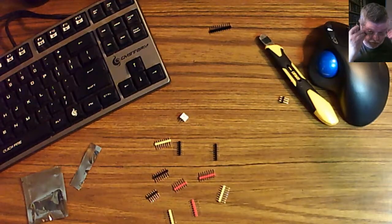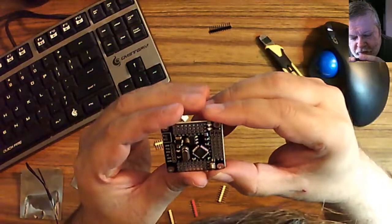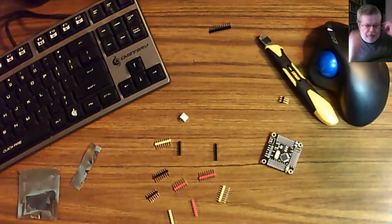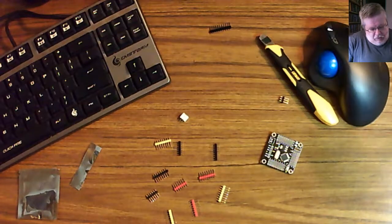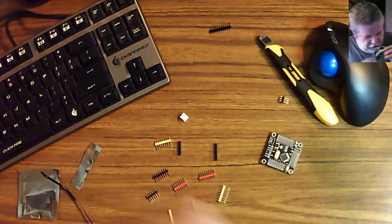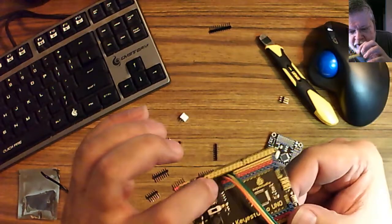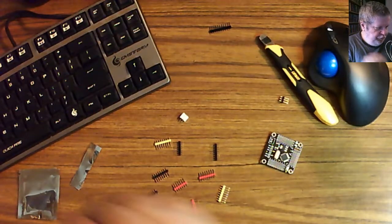So I need to take my glasses off for a sec, and we have to kind of look here. SVG. Now I have an Uno here that has the same color scheme for pins. So let us have a look at it. It will tell us which is S, V, and G. I'm pretty sure G is going to be for ground, and V is going to be red. So S is yellow, V is red, and G is the blue one.